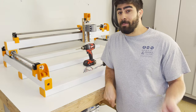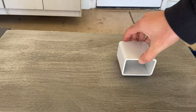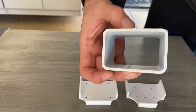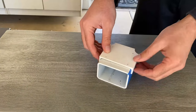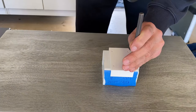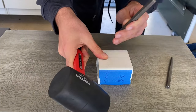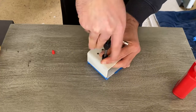With all that said, let's go back in time and go through how we got to this point. First up are the Y rollers. I labeled these with masking tape to protect the paint job and keep track of which side is which so you don't drill them incorrectly. I used the printed guides to punch all the holes — I think it was tools four and five for the top and bottom. After that, you'll want to drill them out and tap them. I absolutely love tapping — people in the Discord think I'm crazy for it. Take extra care to drill everything as accurately as possible; it saves a lot of time later on.